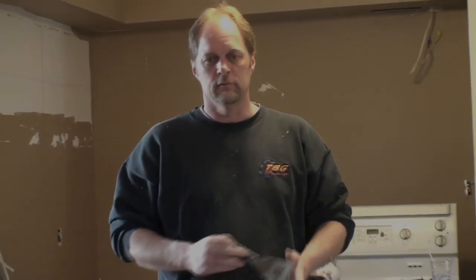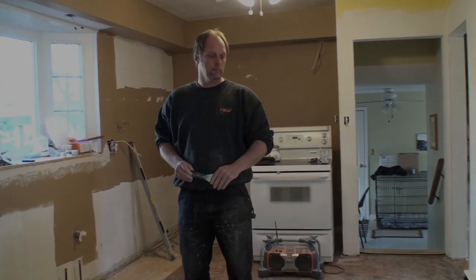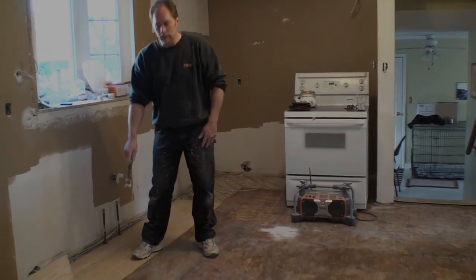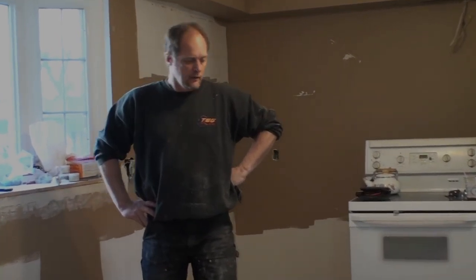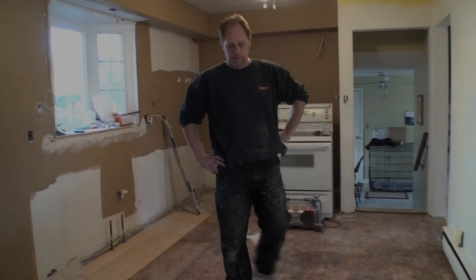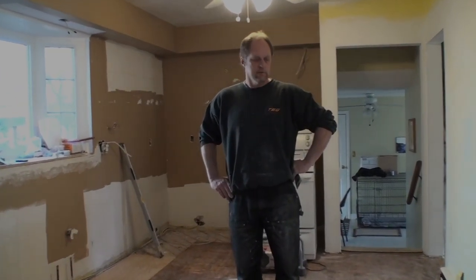Hi, this is Ted. Since the last time you were here, we've taken out 4 layers of flooring. What we realized when the cabinets arrived was we were going to end up with a 2.5-inch space along the kick plate of the baseboards, and the flooring wasn't big enough to cover that. So we ended up pulling out 4 layers of flooring, and we put a new subfloor in underneath where the cabinets are going. So now we've ordered some flooring, and it should be in a couple days, and we'll put that in after the cabinets arrive.